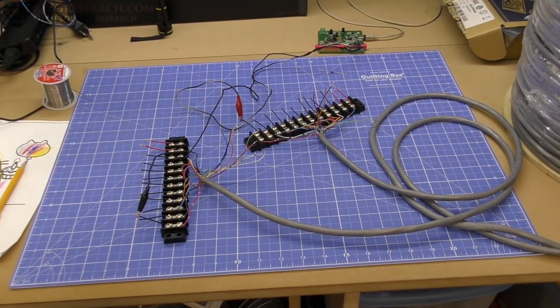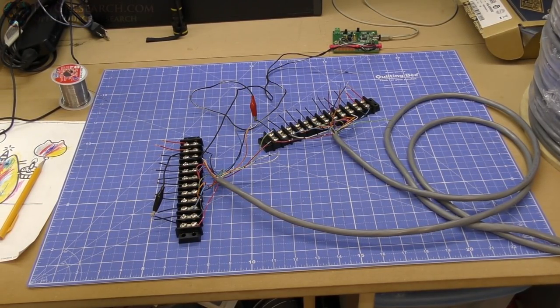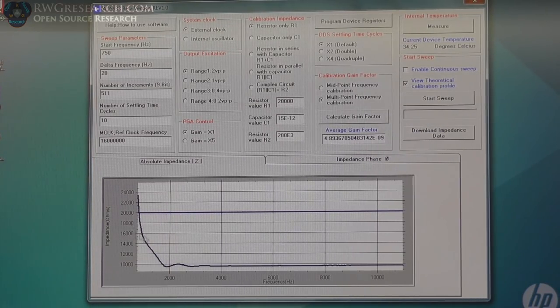All right, first things first, I'm going to run the test just like this and show you what it looks like on the screen. However, it's really high of a frequency for the self-resonant frequency with one wire, so it doesn't show, but let me show you anyway. As you can see, there is this little bit of mess right here. The beginning of the curves are always a little screwy, and I also do not trust the actual resistance, or I should say impedance measurement here. I just use the graph as a reference for frequency. I'm probably doing something wrong to get this correctly. I probably have to calibrate it with the resistance of the coil or something.